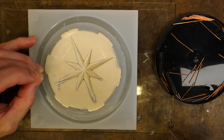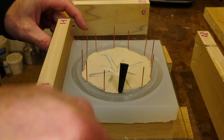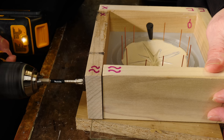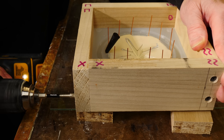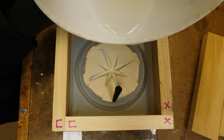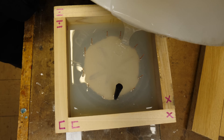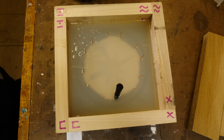Let's start adding all the vents. This is copper wire, about an inch and a quarter long. The sprue is in black — that's a 3D-printed part — and I superglue those all into place, then put the mold back together. This is where marking the sides comes in handy so you know which piece goes where. Before we can pour more silicone in, we need to put some release agent on the existing silicone facing us. I'm going to use a stiffer silicone here — a TC5150. I pour it in the middle and let it flow out, always pouring on top of the silicone and letting it flow out rather than pouring randomly all over the mold. You want to pour from one location, ideally.